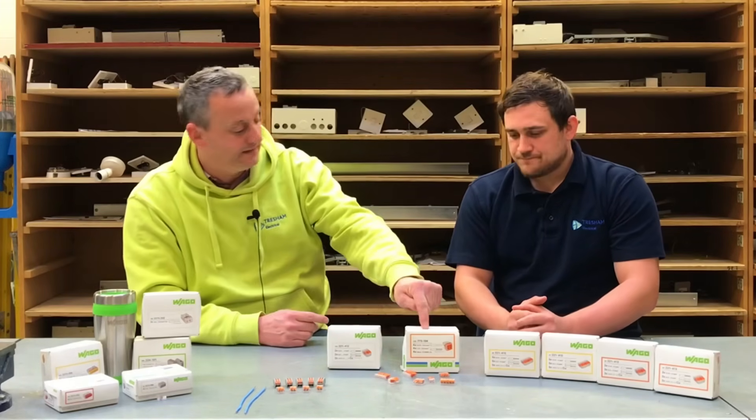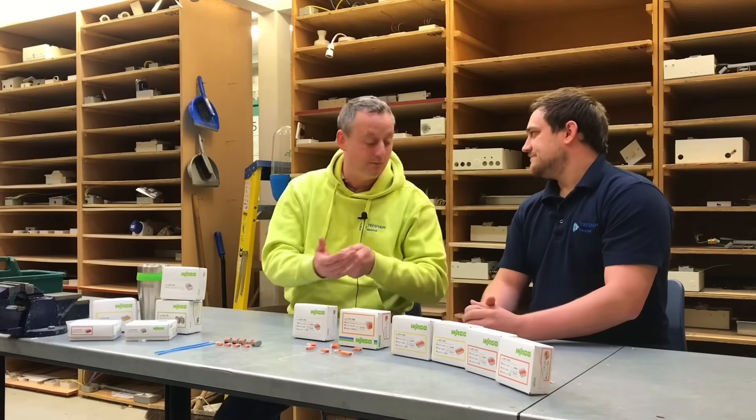Michael Lane also asked me to clarify on camera, because not a lot of people know this, that on the 221s we've got two different voltage ranges and two different current ranges on the sides. Later on in the video, we're just going to clarify which one is going to be used for Europe and which one is going to be used for Japan. Also in this video, we're going to show how on things like the 773 push-fit connectors, how easy it is to remove the conductors — just a simple twist and pull, so we don't have to be throwing them away. Early days when they came out, I was pushing them in and then just cutting them off. Especially in a college where we're going to reuse connectors over and over again.